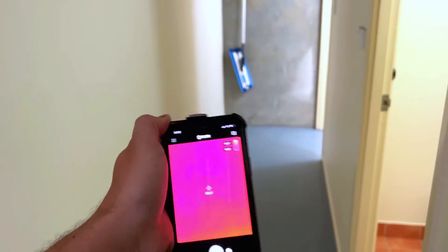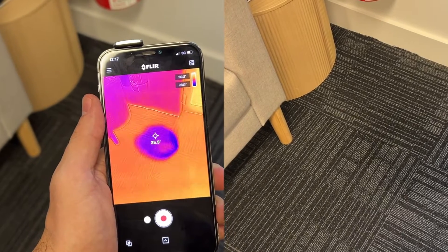With a simple glance you can see the spread of moisture from the FLIR. The FLIR ONE app allows you to take photos and videos through the thermal to give a nice contextual and thermal shot. This is great for reporting as it visually shows the water damage in a comprehensive way, making it easier for the client and insurance companies to understand the extent of damage.